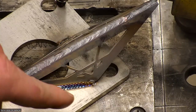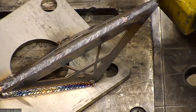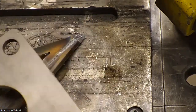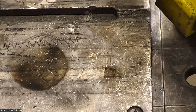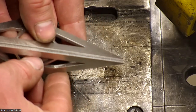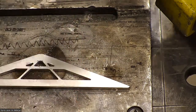Even with that, you can see the heat-affected zone is pretty minimal. As long as you have the power set right and you're not way overpowering it, you shouldn't be burning through. You do have to play with it and figure out your settings. The joint that's ideal for the laser welder is going to be pretty much like this — you have a slight gap on one side, and I'll try to mimic that as much as I can.